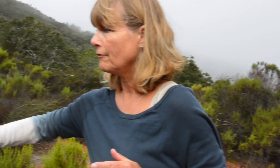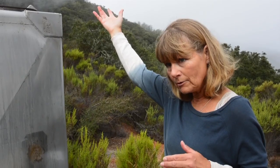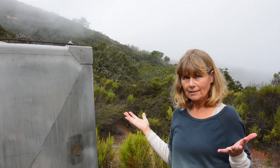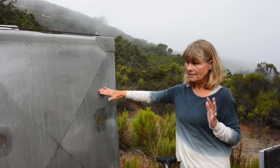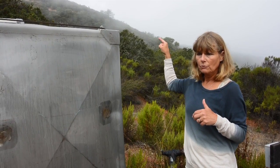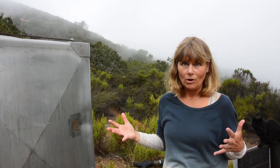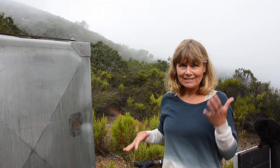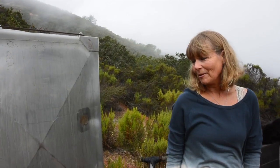When this is half full, based on the rate of fill to the rate going out, you don't have to monitor it. At 5,000 gallons at the top feeding into this, it's an equal balance between what's coming in and what's pumping up. I'm not a mathematician, but it's really just trial and error and checking on the pump constantly, because I'm water girl. So you check on the balance in the feed and pretty soon you got it right. And then once it hits here, you can turn the pump on.